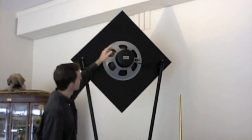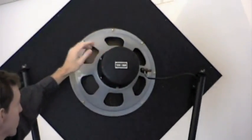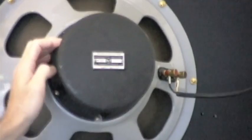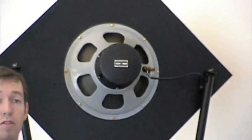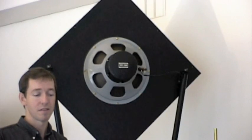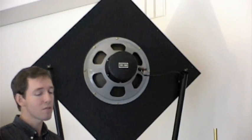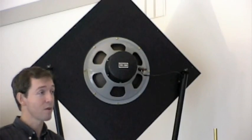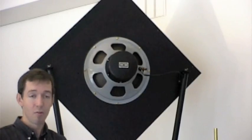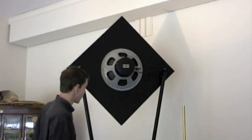This is a loudspeaker from the 1940s. This huge black thing here is the magnet — an Alnico magnet. It's extremely powerful, which means this loudspeaker gets very, very loud with very little power. In fact, this theremin is certainly powerful enough to fill any concert hall with sound, yet it produces less than two watts of audio output. Today we're used to amplifiers with hundreds of watts and great big banks of speakers, but this is a musical instrument — we don't need to use force, we need to use finesse. If I hook this theremin up to some other loudspeaker it may not sound so good; it would have to be readjusted. It is matched to this particular speaker.